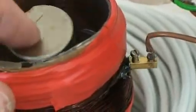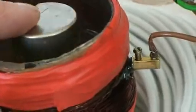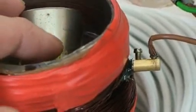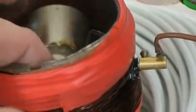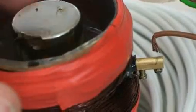You can see as the magnet goes up, touches the commutator, which then energizes the coil. The coil is then energizing inversely to the magnet, so the coil is wanting to get the magnet to that position. If you had to bring it up to there, it would energize and flip the magnet over to there.